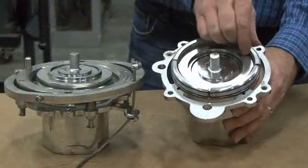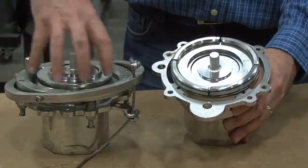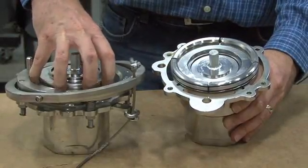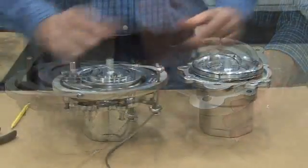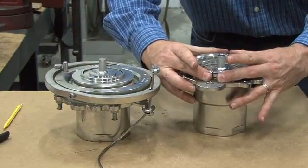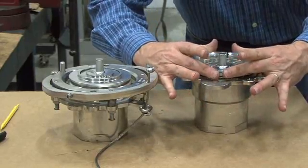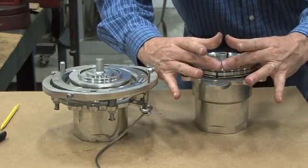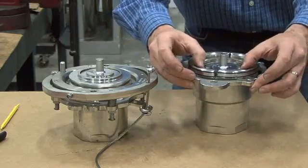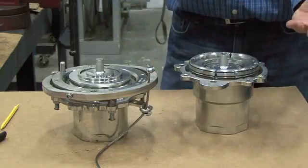Here we get a better look at the four sections. When the unit is in service, these sections grip the flange on the other half of the coupler, holding it in place. The ring goes around these sections and clamps the two sides together. With the slide ring around these holding sections, the unit cannot come apart unless a specified force pulls the cable, which then pulls the ring off the sections, causing separation and shutting the poppets instantly.